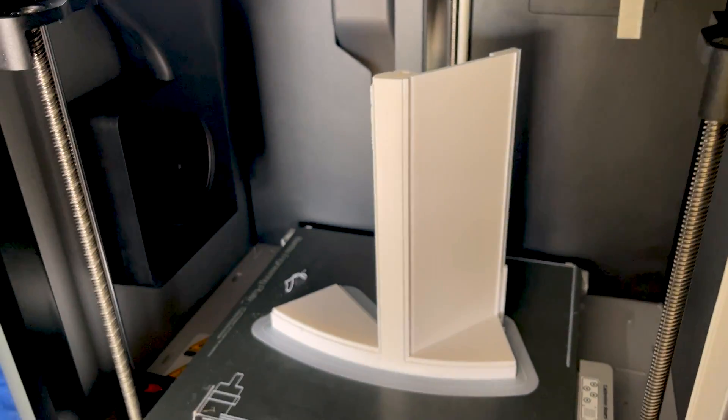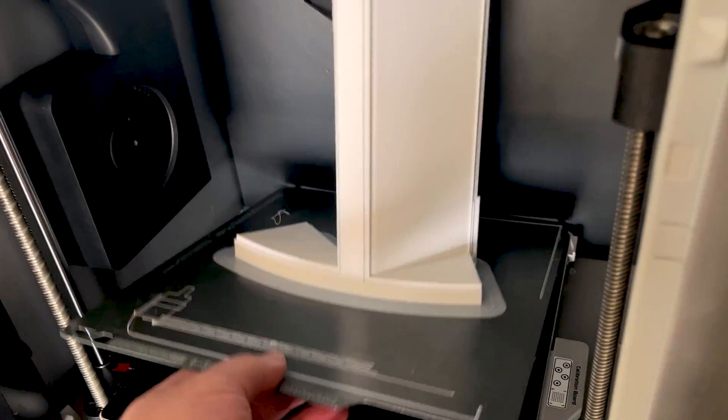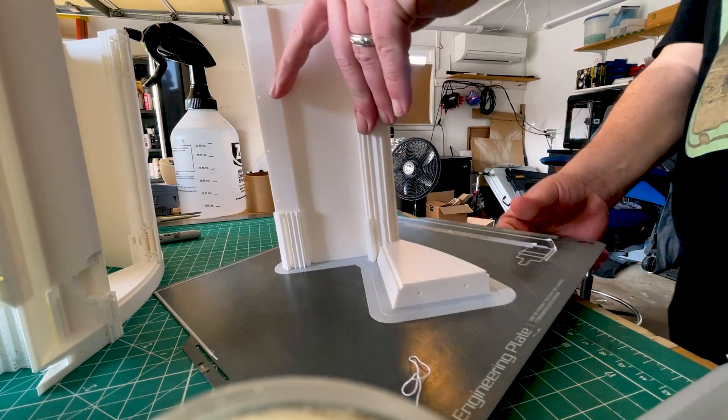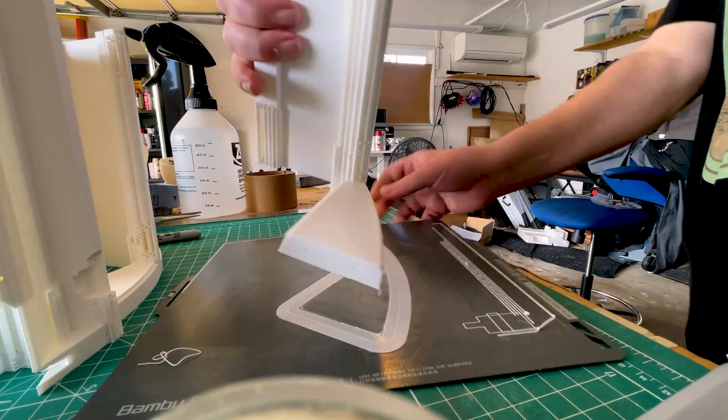As I said at the beginning, results for interrupted prints have been mixed. There are a few different factors that may be contributing. I'm only printing in ABS plastic. ABS can shrink when it's finished printing, as it cools off. So maybe the filament going on to the interrupted print is hotter, and so it's slightly a different size when it goes on. I also have some strange environmental factors here in my shop — a fair amount of humidity in the air sometimes — and even though I have factors in place to try to limit that, it could be having an effect on the plastic as well.